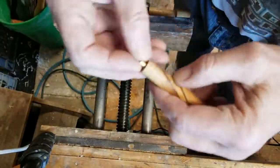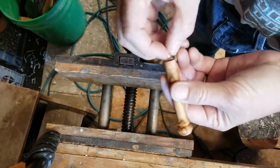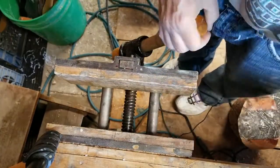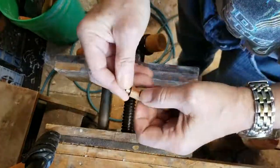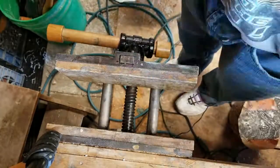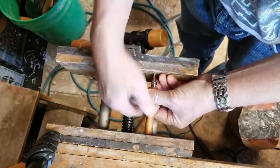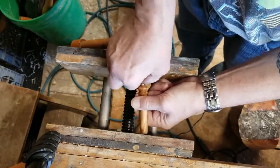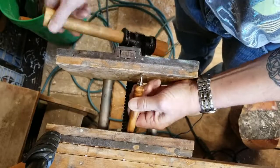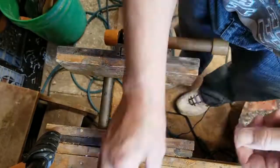Now put the insert in — a threaded insert. You have to put it in with a little indentation inside first so it slides in a little bit easier. I happen to use this woodworker's vise. There are also pin vices and other methods of getting these in, but this is my preferred method. The longer pieces are a little bit tricky — they tend to push off center as you try to press them in — but eventually you just work it a little bit at a time and you get there.